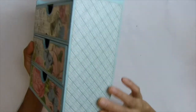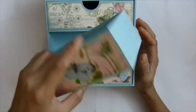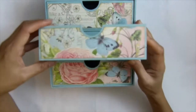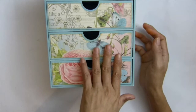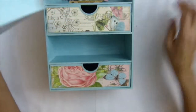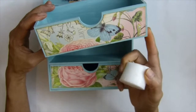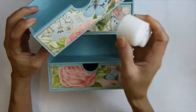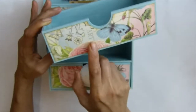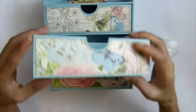I layered the paper and my parts. I made this really well — this drawer is not stuck. If you don't use the candle to melt it, it will work, but using the candle makes it easier to take in and out. When you want to use the candle, heat the wood really well and then rub the candle — the candle will melt better that way. Just rubbing the cold candle doesn't work well. Heat that side and rub it; the candle will melt into it. That's a really good technique.